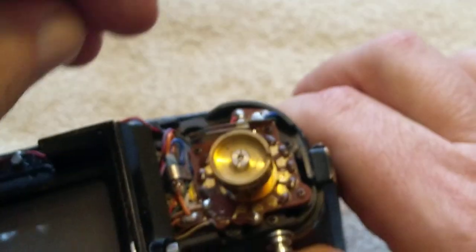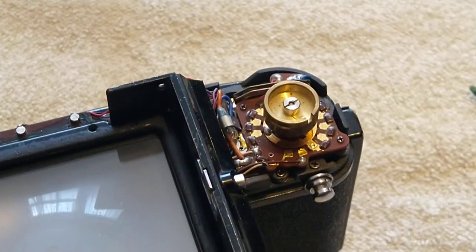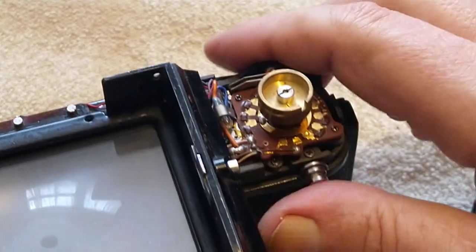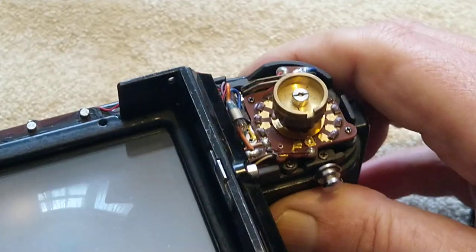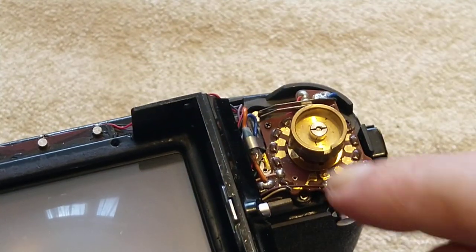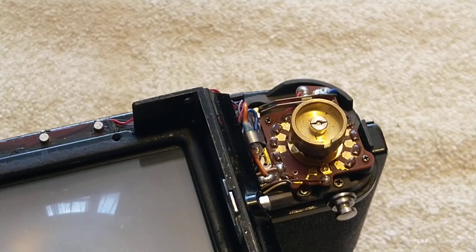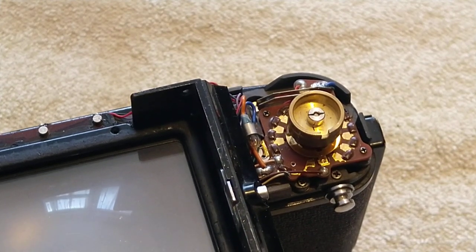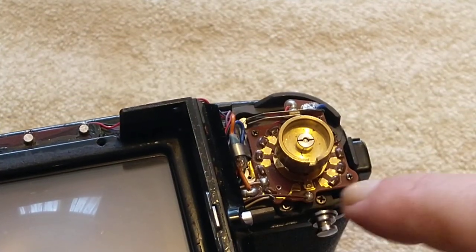I'll turn this around. That one should be B. There's one second. B, then X, then the faster speeds. You don't really need to remember exactly where this was — you can set this to a speed somewhere between, because there are three of them, maybe a quarter and an eighth, possibly a half to get to the three. They're kind of equidistant screws when you put it back together. But yeah, that's your shutter speeds around there.